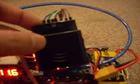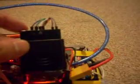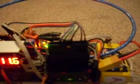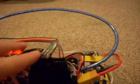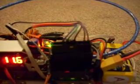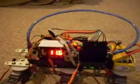And this right here is a wireless dongle for a PlayStation 2 controller. This would be the part that would actually plug into the PlayStation 2, and I just used some pins to connect it to the Arduino, and there is an available library that makes it basically plug and play. If you just follow through the library, it communicates with a serial bus between the Arduino and the host, and the controller receiver, and in the code you can query whether the button is pressed or not. Makes getting your project remote controlled and wireless very easy.